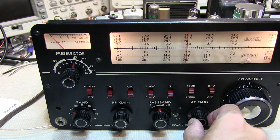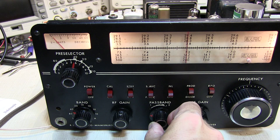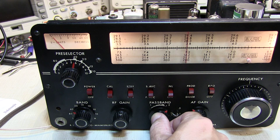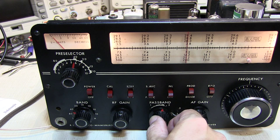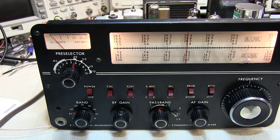It doesn't really matter what band we're on. I've got it set to 40 meters with the preselector optimized. We'll listen to the noise here — product detector is on with the BFO. Let's listen to the extremes of how high pitch the noise goes at each end. To me they sound pretty darn close — certainly close enough that I don't worry about making any changes to that adjustment. That brings us to the end of the alignment of the 2B. I think it was all quite successful — a couple of minor tweaks, especially to the oscillators which were a bit off at the very beginning, and the preselector at 10 meters. Those were the three things off the most, but I'm really happy with the way this came out. I hope you enjoyed the series here on the 2B — thanks for watching.